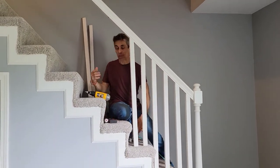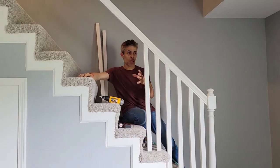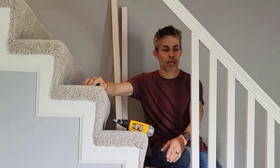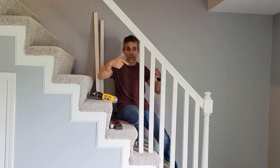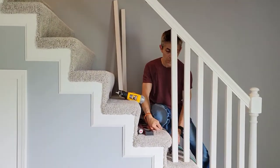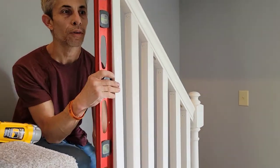We had some regular spindles here, the round kind, and these guys had these holes pre-drilled, and I tried every effort to try to match up these holes, but they weren't on the same layout. So I got this idea just to go down and grab some 2x6s and rip them down and make 2x2s, and this is what we're going with now. So we got us some spindles, and it's a lot easier to level them because they're square, not round.